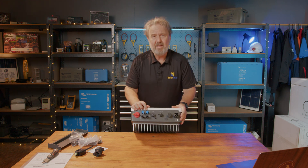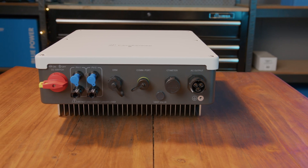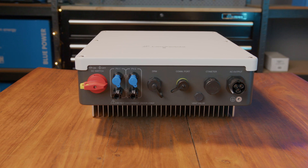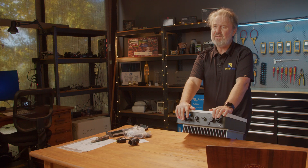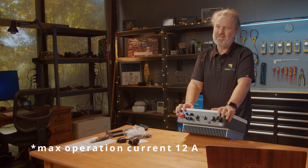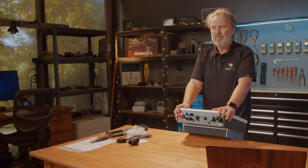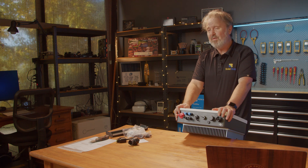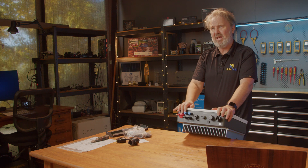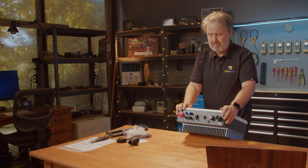We've got PV1 and PV2 inputs here — two arrays. Looking at the spec sheet, these are rated for up to 15 amps short-circuit current and 12.5 amps of operating current. So they'll work with even your large cell sizes where we're starting to see short-circuit currents going over 12.5 amps — these can take up to 15 amps at the plugs, sockets, and connections inside. Dual MPPT — that's a big tick.